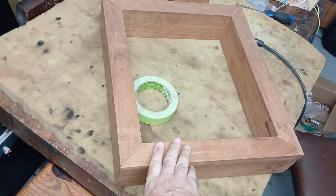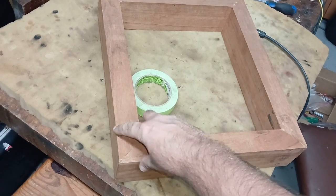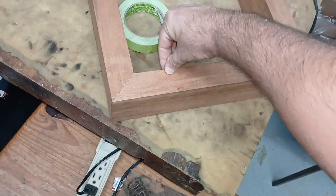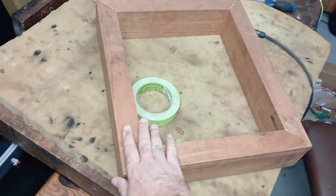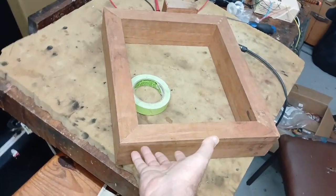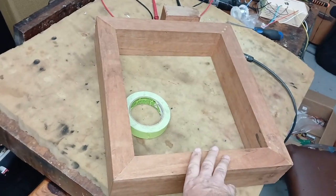As I mentioned before, this 45-degree glued joint doesn't have a lot of strength on its own. It's really going to rely on that block reinforcement for strength. So not only glue, but screws going in is going to be a good strong way for this to live. Just in case, who knows, sometimes it might fall or whatever. You don't want the whole thing cracking apart, right? And you can't fix it.